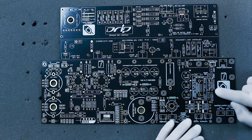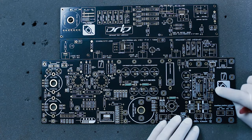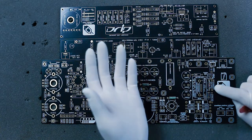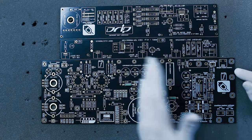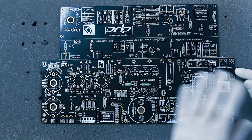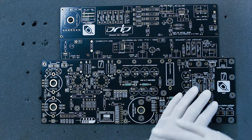In the heater it says 1K fixed. If you did not want to use a trimmer, just skip the trimmer, add a 1K — it puts it relatively around 6.3 volts, give or take, whether the resistors are 1% or 5%, but you don't have to split hairs on that. Some folks want the 50 ohm trimmer and get it to exactly 6.3 volts.